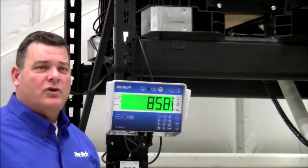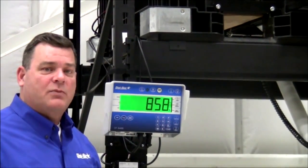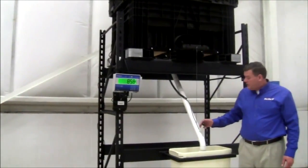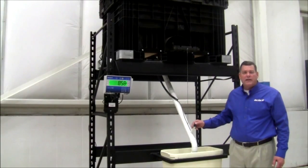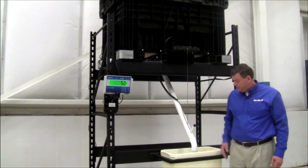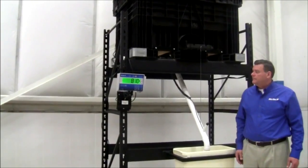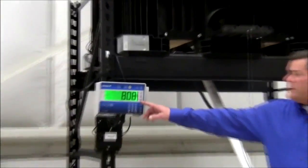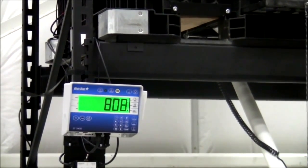When you're ready, move your chute over to your planter. Once you have moved your chute over to your hoppers, you will then press the button on your seed tender to dispense the 50 pounds that you have preset into your indicator. You will notice that on the indicator it will count down, and a red light will flash when you get closer to the preset amount.